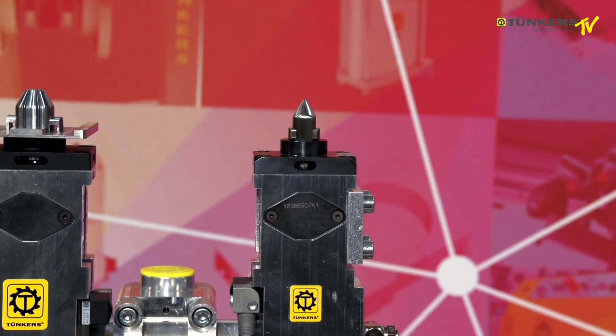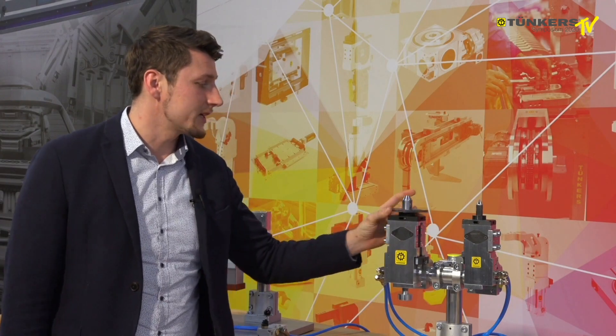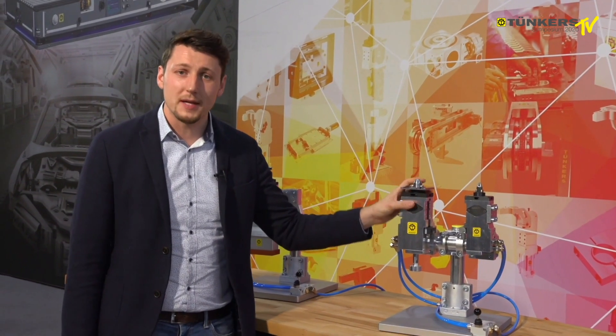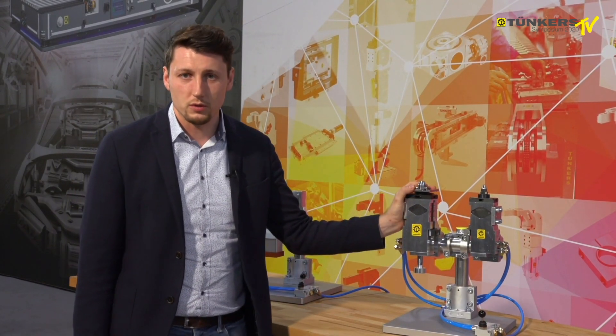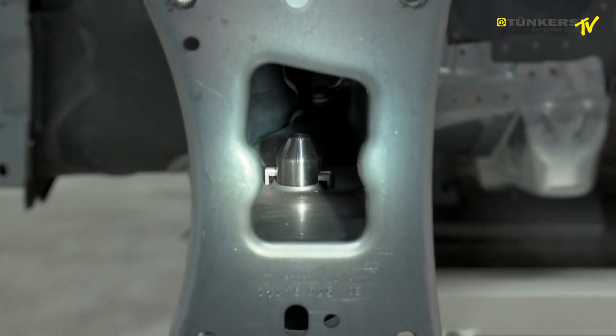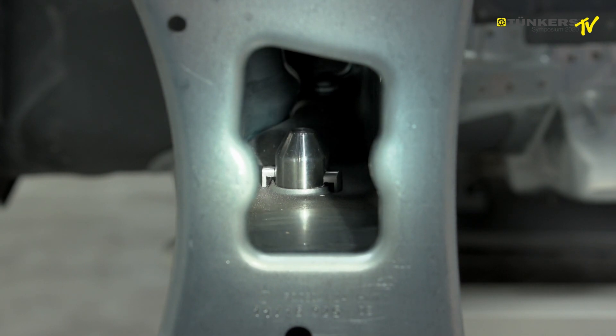Another underbody clamp is the STZ, of a much more compact design, in the 40 size and also the very new 50 size. We have sheet thickness compensation, as in the K63UZB — we can clamp different sheet thicknesses and hold them reliably. The special point of the STZ is that we have a fully encapsulated clamping system, which means that all mechanical components are completely protected from dirt. There is also an integrated mechanical system to ensure a motion sequence in the pin or mandrel and the clamping jaws.